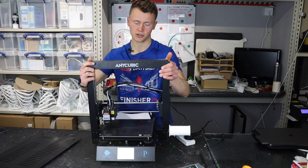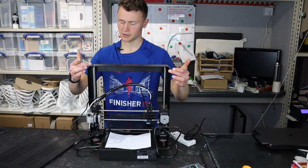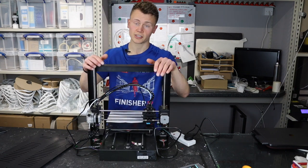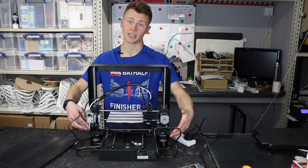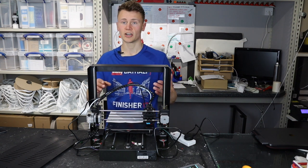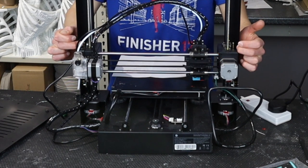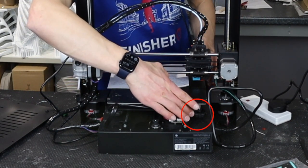The z-axis on this printer is good — it's got two lead screws, both driven from separate stepper motors, which you wouldn't always expect on a printer so small. Following on from that, they both have their own end stop, which is really good because it's possible for the z-axis on either side to get slightly out of line — enough to throw your bed leveling off if you've only got an end stop on one side. The little end stop adjustment screws also give you extra fine control in bed leveling.